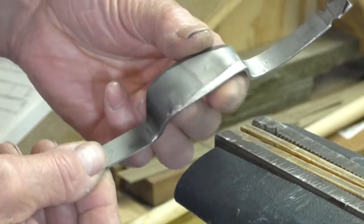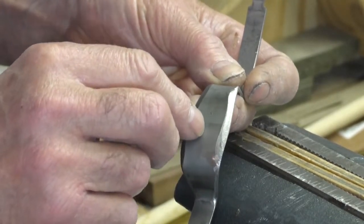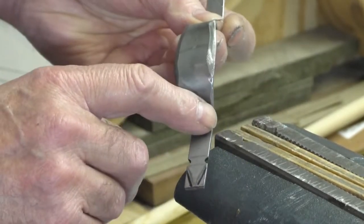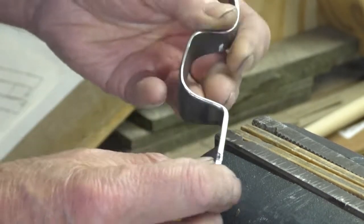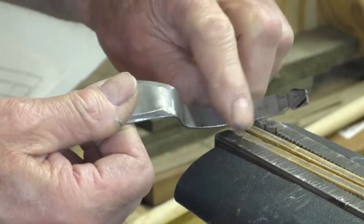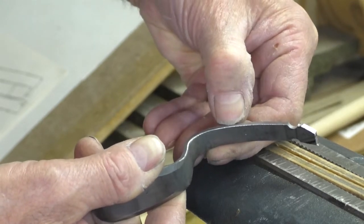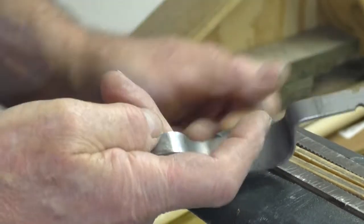getting these filed out. Then I'll be filing the sides here, the bow out to like a center line here, and this area in the front I'm going to bevel 45-degree angle down to halfway, and part back here I'm going to round over halfway, 1/16 of an inch. So it'll be a 1/16 inch into the wood, and then this part will be rounded over where your hand goes.